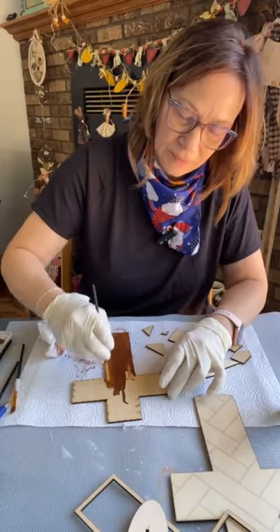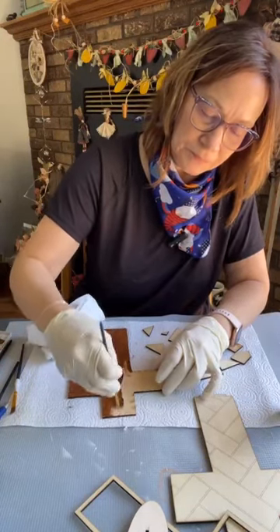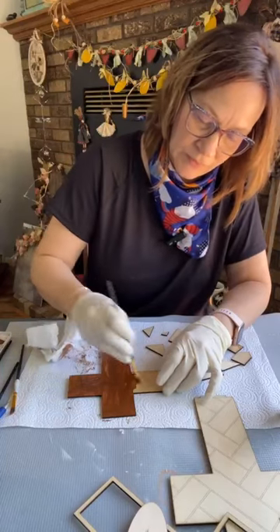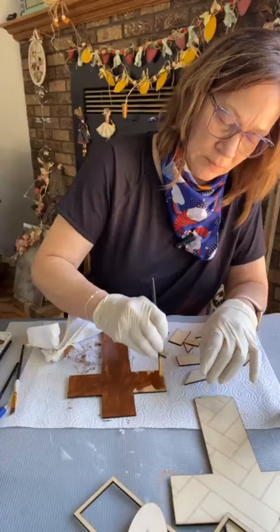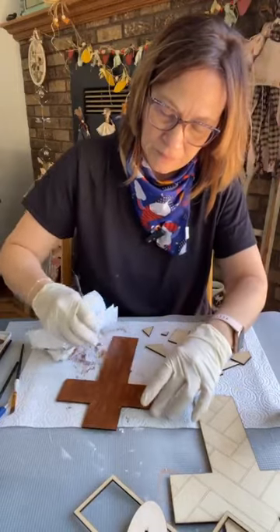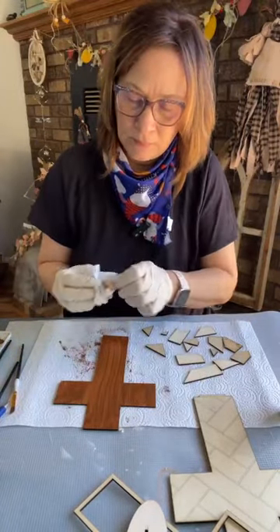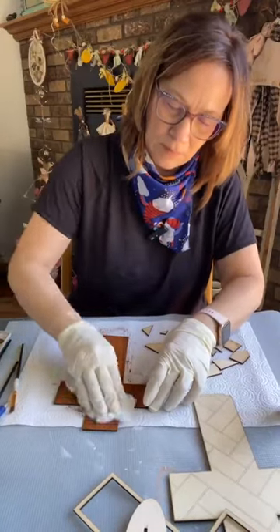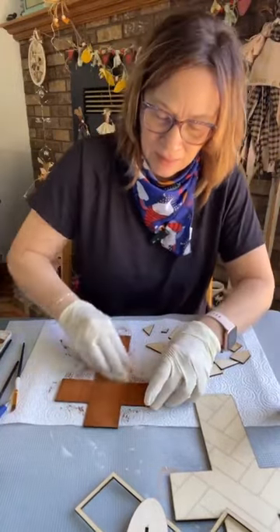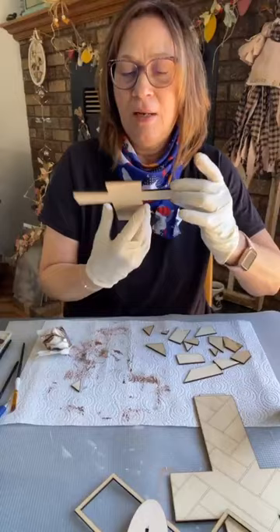You might want to do the front and the back. The front of it, you don't have to do all the way around because you won't see most of it — you're only going to do a little bit. Just get good coverage; you don't have to be real picky about direction or anything. Just wipe off. When you wipe it off, you might want to wipe so that you have a little bit of a straight grain — otherwise you'll see variation if you wipe in the opposite direction. Gorgeous.